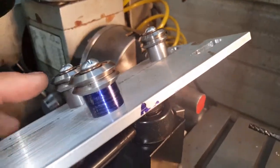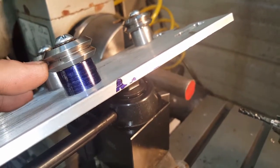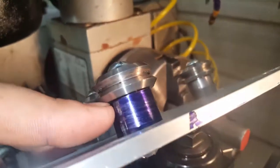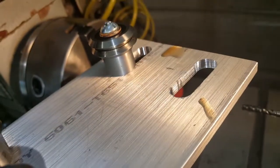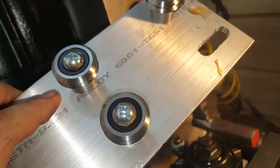The dimension isn't crucial, but I turned it down to fit this bearing, put a little relief on the shoulders, and turned it down to fit the slot that I milled into the plate. Then threaded both ends — it's just as simple as that.